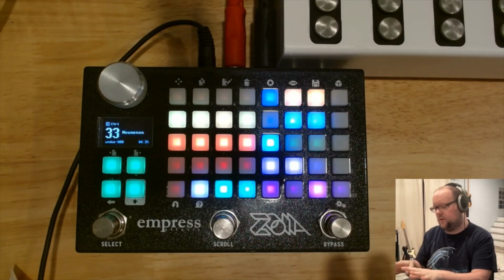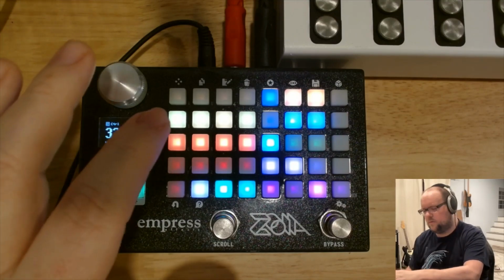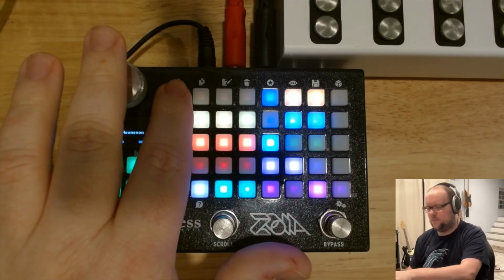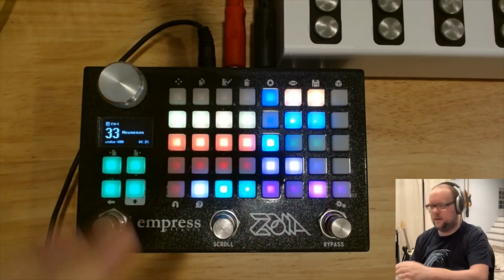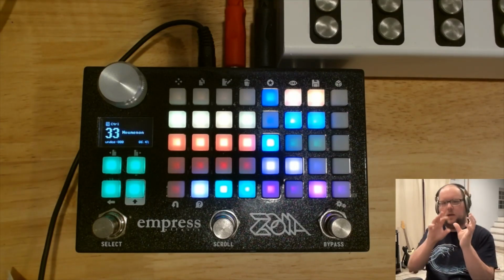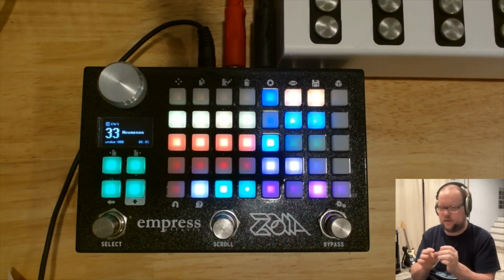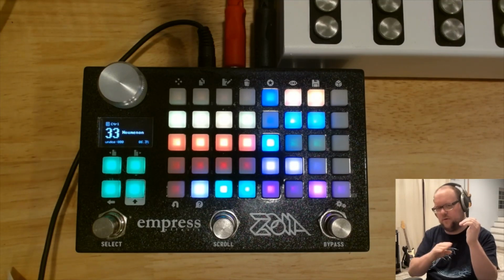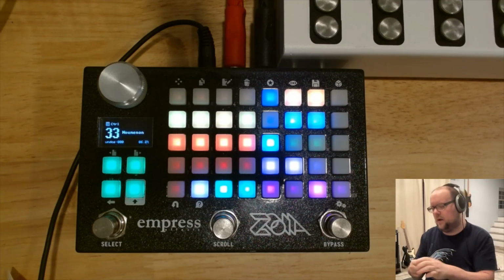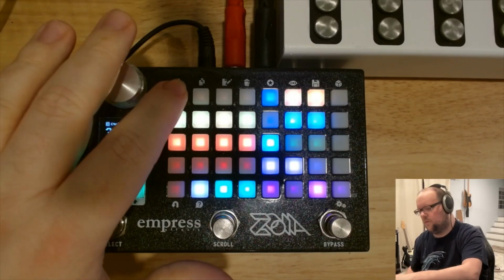The way that it works is that there are 4 oscillator voices that are pretty simple on their own. I'm going to press this button here, and you can mute and unmute any of the oscillators by pressing these buttons up here on the top row. The muting works such that the voice is formed from the oscillator going into a VCA that's modulated by an LFO. When you mute it, it will wait until the end of that LFO cycle to mute, so it won't be immediate. And when you unmute it, it will restart the LFO cycle so that it won't just pick up right in the middle. You'll get this sort of smooth rise. So we have 4 of these oscillators.